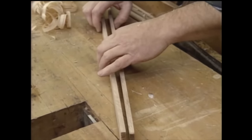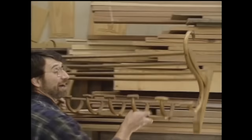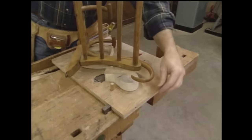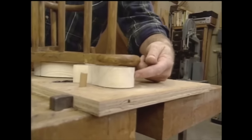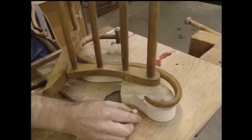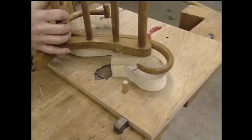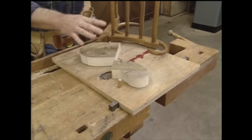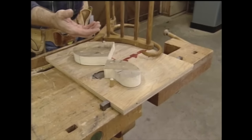Also, this size, when glued together, will give me the cross section I need for our project. Now I need some forms around which I can bend the steamed oak. As Mike recommended, I started out with some three-quarter inch thick plywood, and I attached some one and a half inch thick stock to it, approximating the shape of the piece that I want. I've also installed some dowel pins which will hold the piece in place while it cures. Note that the size of the plywood base is that of a large cookie sheet, so I can fit it in my oven to accelerate the drying — otherwise I'll have to let it sit in the shop for several days.